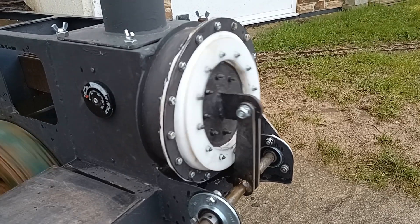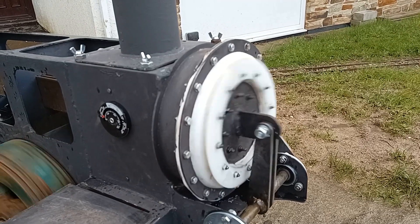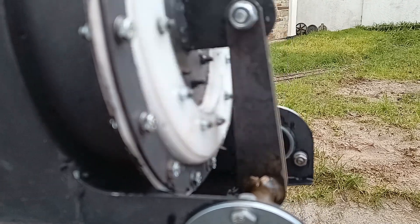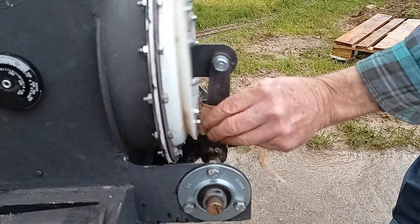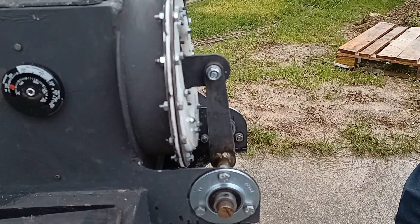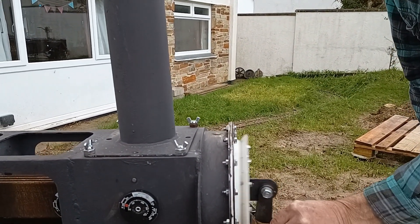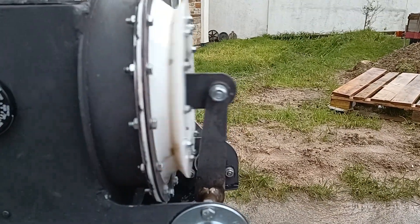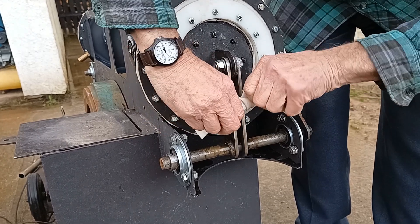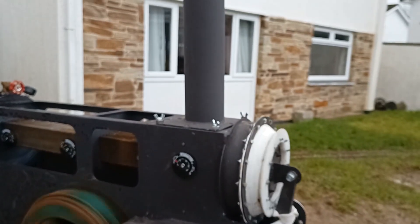The first thing noticeable is the noise of the silicon seal over the natural rubber one - it almost sounds like a ball bouncing. We've also got a bit of knocking; I think it's hitting the swing arm, which doesn't help the situation. A little pad in there stops the knocking, so it is the knocking against the swing arm which is the majority of the problem.